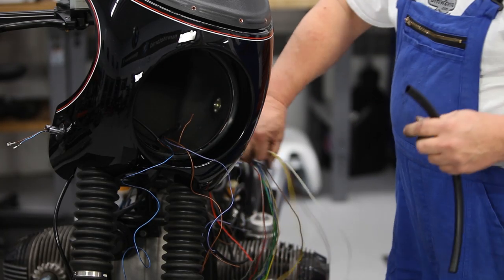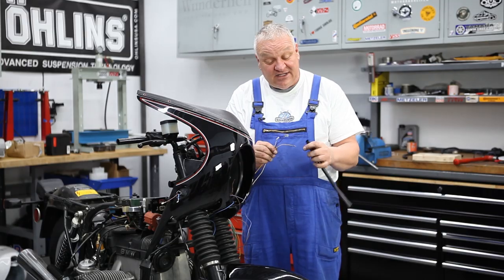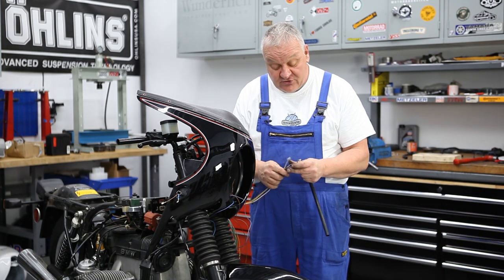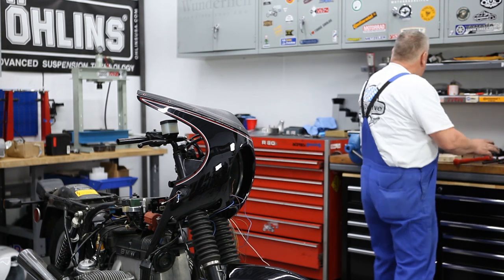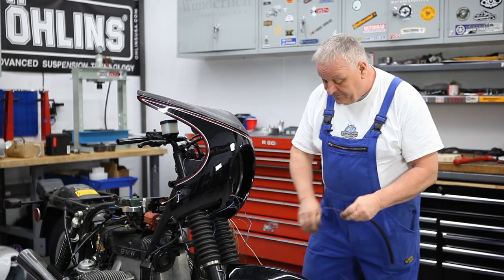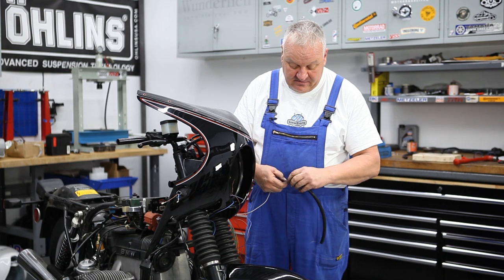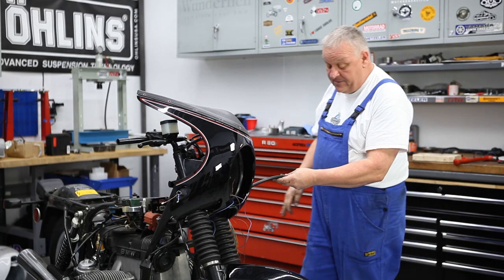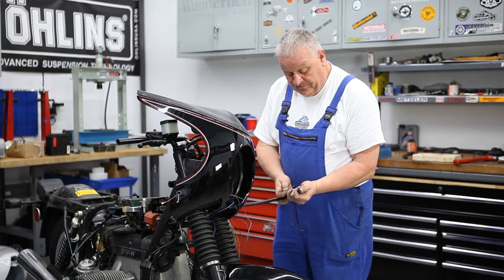The first thing I'm going to do is put these three wires — the ones with connectors on them — through the conduit. It's a little tight but they will totally fit. It's a lot easier to pull a connector through than to push it. What I like to do is take a little piece of safety wire, slip it through the connector end to form a loop, and then pull it through — still need to kind of help it along.